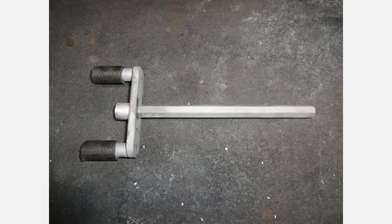Here's a photo of the finished part. I ran it through my sandblaster, but it could just as easily have been painted. Now here, here, and here we do have press fits. I didn't know if they would be strong enough to do the job, but I had planned to just put some welding tacks on them if they didn't. It seems to be just fine — everything's working fine the way it is.